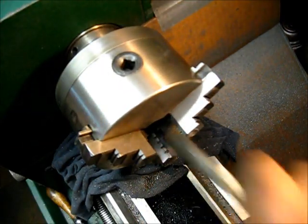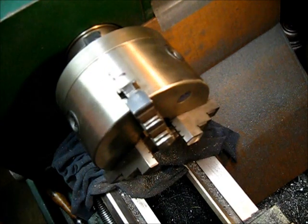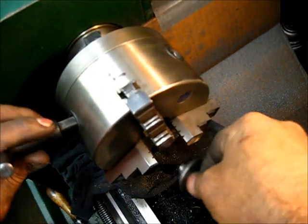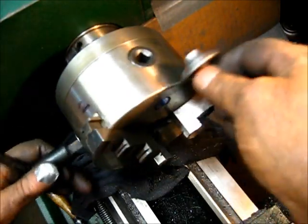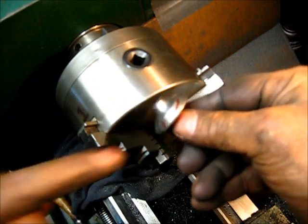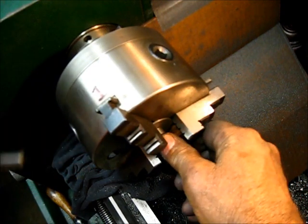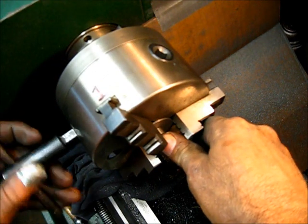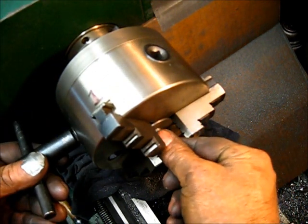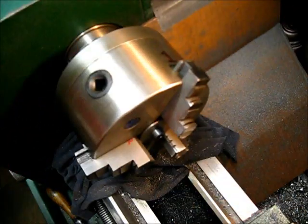Let's do another. Y'all remember now, when you're working around this high-speed machinery — and even right now when you're taking these out and putting them in there — you want to index the part back into the chuck jaw where it was at, so that it will be true and lined up. It's got a little pocket seat right in there, and that makes it fit really, really good.